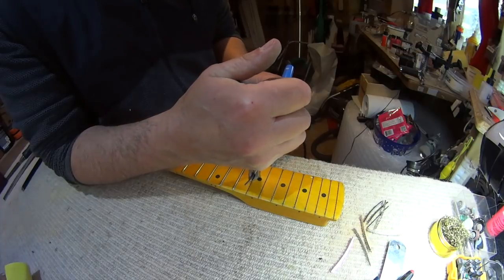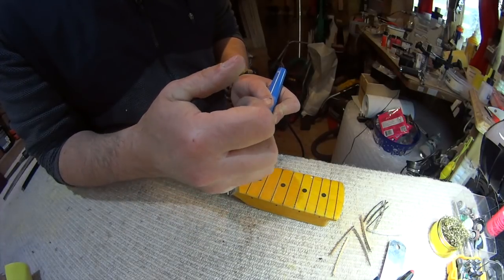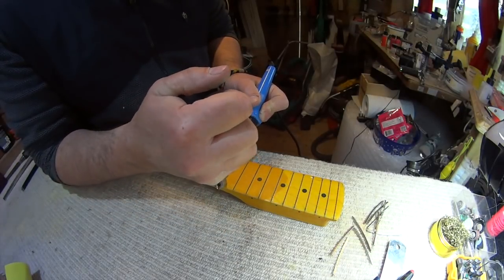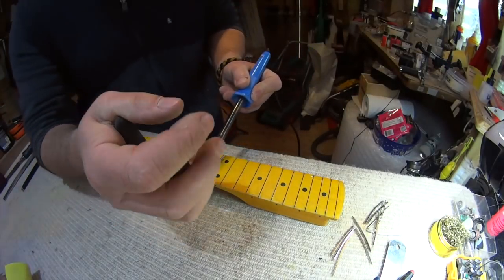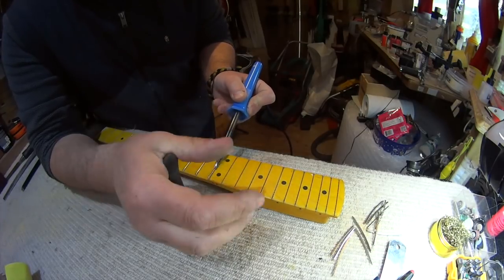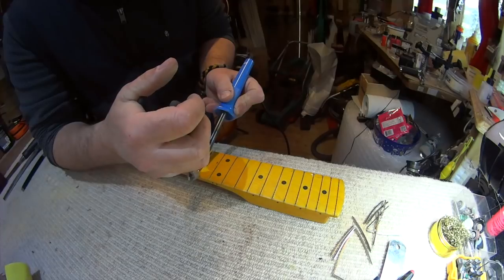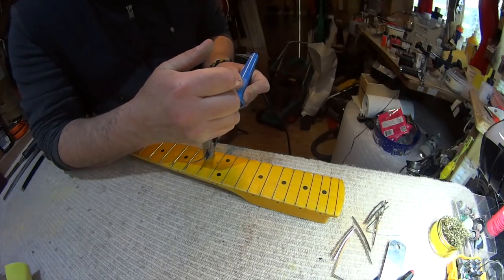Here we go. Now, when you're refretting like this, or defretting, the thing we're going to do is sand back this fingerboard. I'm going to do it with a 16-inch radius block, because I know these factories, the Chinese factories, make these with a 16-inch radius, which for them is a good compromise modern radius. It feels a bit too flat for the vintage Strat player of old. However, it is a really good commercial compromise for these Chinese manufacturers, because it is flat enough to allow you to set quite a low action, usually without choking off the bends.